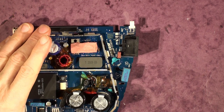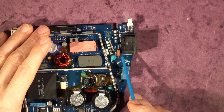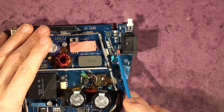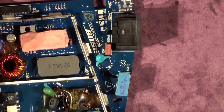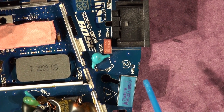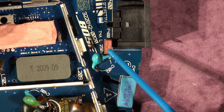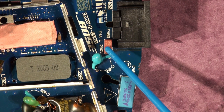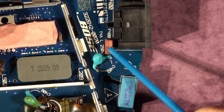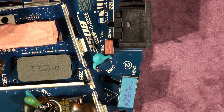A quick overview of what's on this board: you've got the mains input socket, a 4-amp slow-blow fuse — though calling it 4 amp is a bit of an exaggeration because it can sustain quite high currents for quite a long period, more like a Type C circuit breaker. It blows if you've got something catastrophic happening. If you do change this fuse, make sure you put the right type in, because a quick-blow one will fail after maybe 20 or 30 switch-ons due to the inrush current.